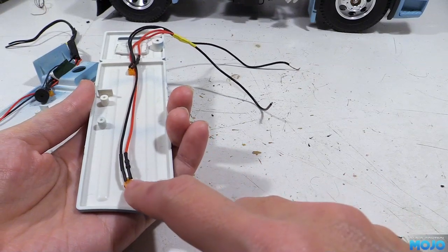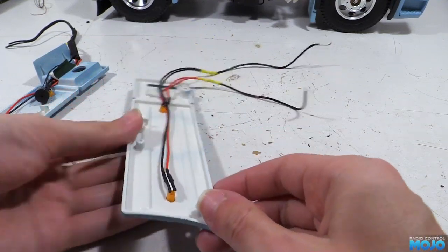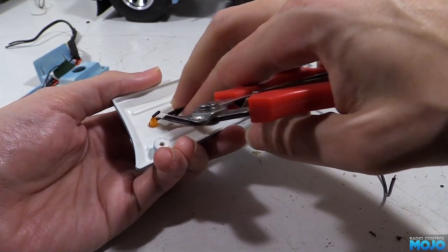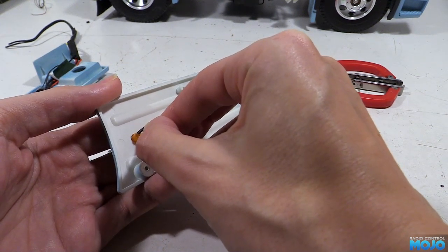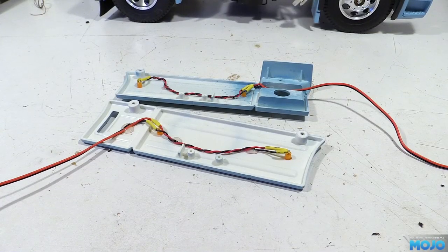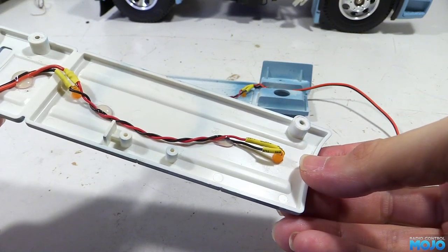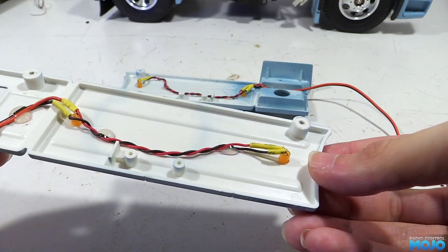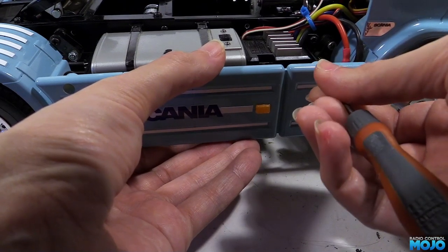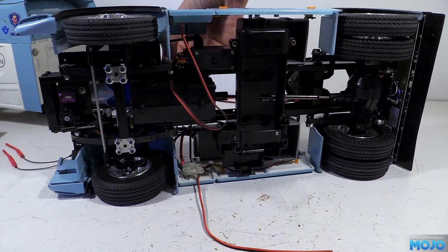There's not a whole lot of point in trying to save any of the wiring. We just need to be very careful about the LEDs as they're glued into special lenses — we need to be very careful not to bend the legs too much and snap them off. If we take care with the cutters we can trim the wires and pull the remains of the heat shrink from the legs. Now we just need to solder some resistors on, add a bit of wire, and we end up with something that looks like this. They're not as neat as they could be but I really didn't want to bend the legs on the LEDs, so they kind of set the path. It'll do though and they'll be safe at 5 volts. To refit we just pop out the screws, offer up the skirt so the holes line up with the stays, refit the two screws, repeat on the other side, route the wires up behind the cab and that's them back on the chassis.